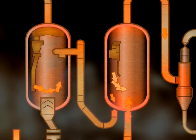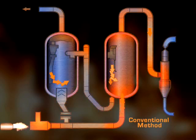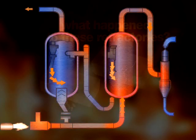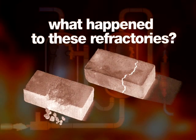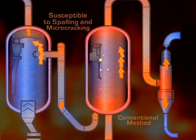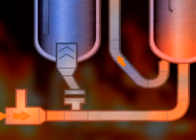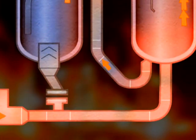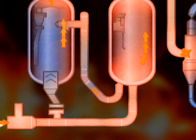And particularly so in some areas like the cat cooler or riser, for instance. You end up with some areas that are heated too quickly and other areas that see little heat at all. The results can be anything from merely detrimental to catastrophic. Spalling and cracking may show up in elevated skin temperatures immediately, in a few days, or in a few months — even in the field joints.